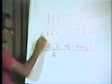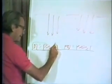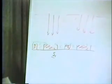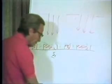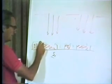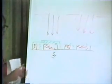But then, again, with a resist and so forth, pieces of it are dissolved away, so they can get little caps and so on, and make more insulator in various layers, each time deciding where the stuff goes by using this photoresist trick. And they're ultimately building up, finally, a metal connector, with the same general idea. Let's say metal is put across from here to here. So now we have two transistors connected together.